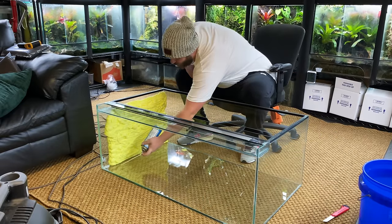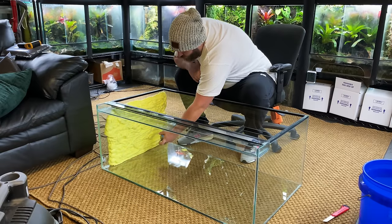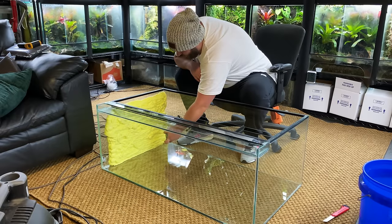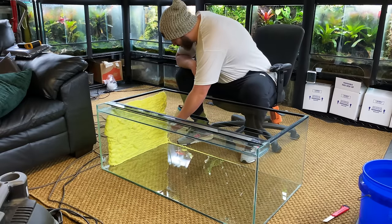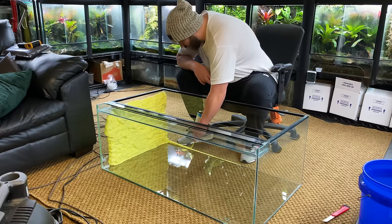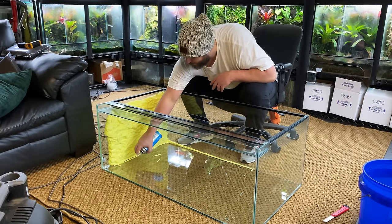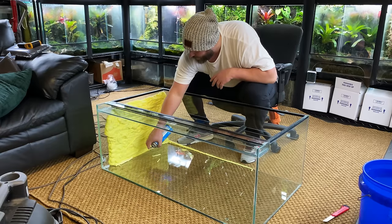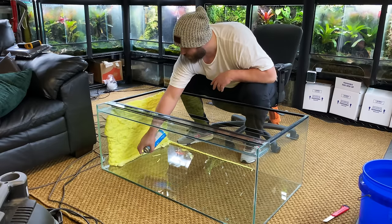So, when I'm applying the foam, when it's on its back, I actually try to lift the applicator off the glass. I don't want it actually on the glass, unless, like there, you can see I have it against the glass and I'm very lightly letting the foam out. You can see there's not a ton of air coming out. You can tell by the size of the foam bead. So I'm just trying to really seal the corner gap.